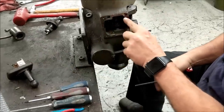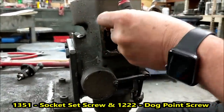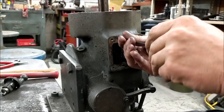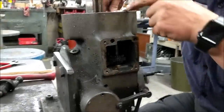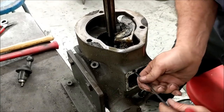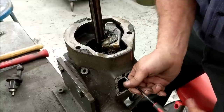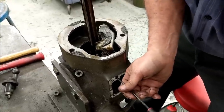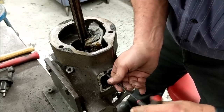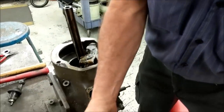Once you have the cover off, you'll notice a third hole right here — exact same allen wrench. There's a little locking screw and a set screw behind it. You do not need to remove them, but you do need to back them out several turns. I'm going to take the screws out so you can see what's in here — there's the locking screw and then the set screw with the dog point on it. Set these aside because I'll be putting them back in.